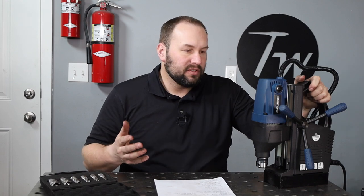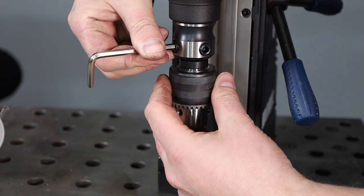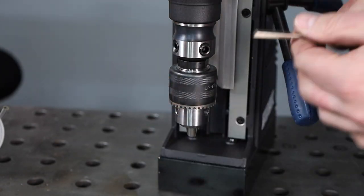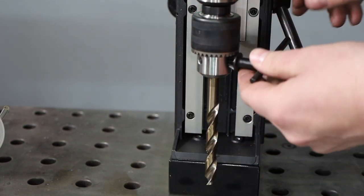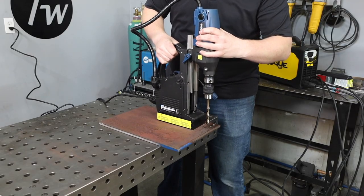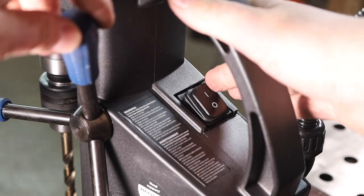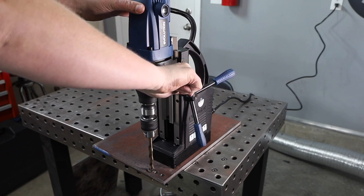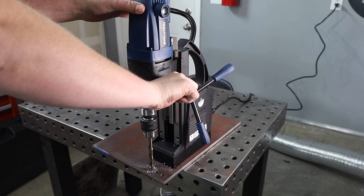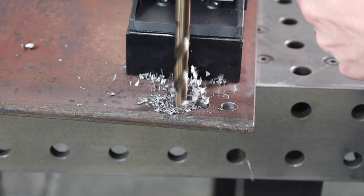Let's start off by setting it up to drill a standard hole using a twist drill bit. I'll just slide the drill chuck up inside here, then tighten two set screws. The drill chuck, as well as the annular cutters, have two flats machined at 90 degree angles for those set screws to sit against, and I want to cinch those down good and tight. Once the chuck is installed, I can go ahead and install my drill bit, tighten it down with the chuck key, then position everything, turn on the electromagnet, followed by the motor, and drill down through. I'm using just a little bit of cutting fluid manually applied, and it is drilling through really well. The speed for this drill is right around 400 RPM.